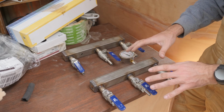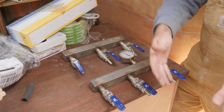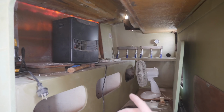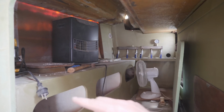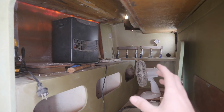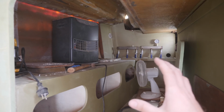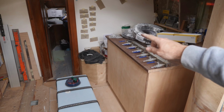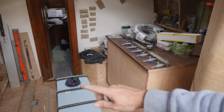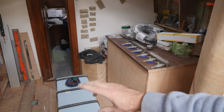And that means I can, for instance, take diesel from this tank here in the galley and deposit it back to this tank here in the galley, essentially polishing the fuel through the filter. My plan is to mount the fuel manifolds somewhere in here in the technical compartment. I will only need to access them about every other month during the winter because of the diesel we're consuming for heating. So yeah, they don't need to be super accessible. I've already got all of the fuel hose for connecting up this tank here, and I've also ordered the NMEA 2000 tank sensor. So next week, hopefully we can get some of this put together and get the kitchen island back in place.